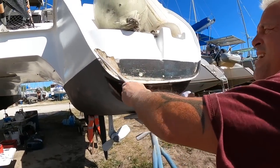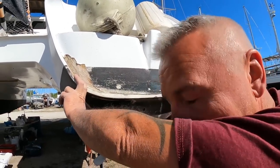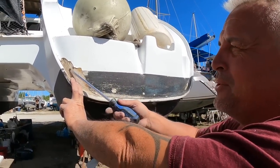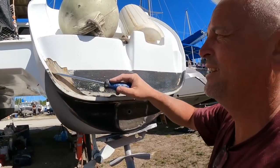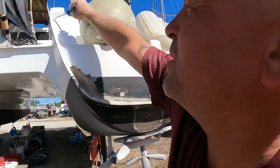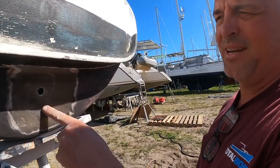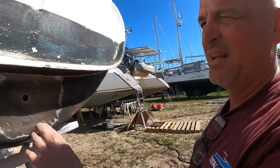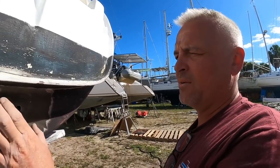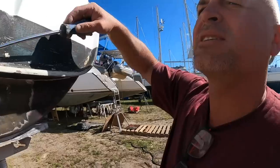This is a bigger repair than I thought. Whoever was helping in the yard in Lubron — I got one of the boys to do it because I had a broken hand — they put on obviously polyester filler, and a little bit on the thick side. That's probably why we got the bubbling up there. I thought it was just where the screw had been and it had popped a little bit of fibreglass, but when I cut it back there was actually some delamination in there as well. So I found it, excised it, rebuilt that, and I'll fix up the rest at the same time.